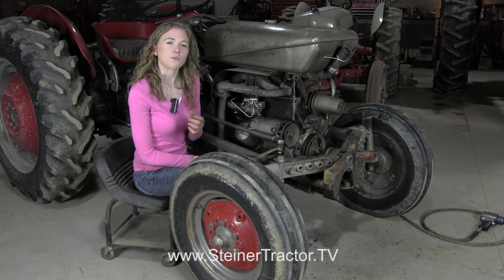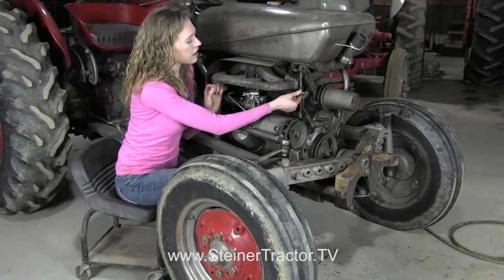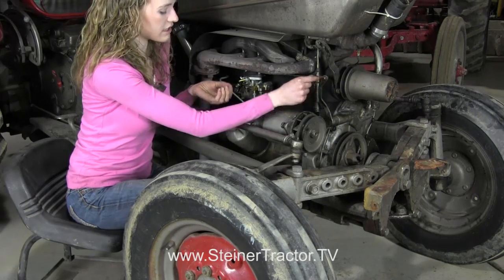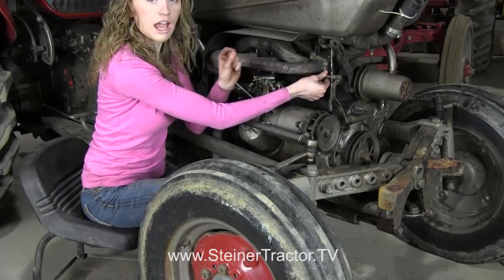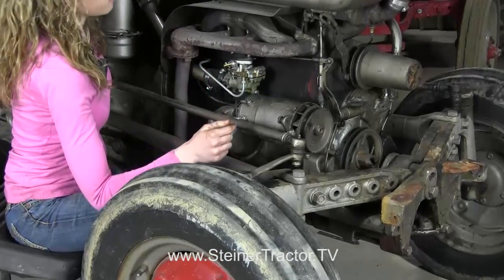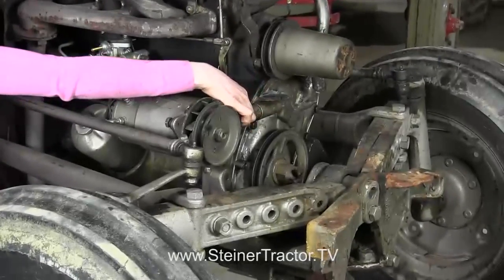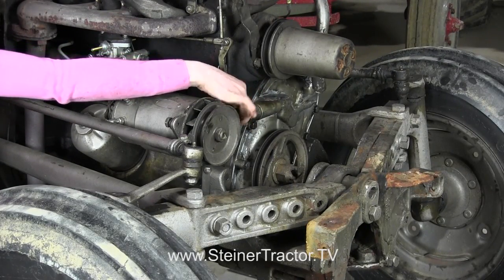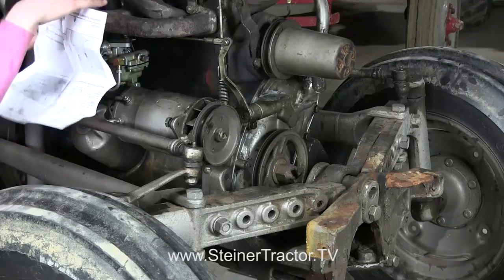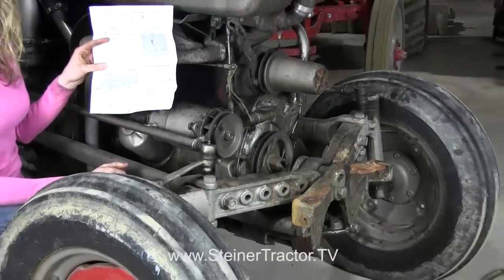My governor is adjusted, so I'll walk you through the steps we took. Right now my throttle is wide open and we made our first adjustment here with this clevis. We adjusted it out so that the pin would slide through easily, and then the instructions say for the Continental engine you take it one more turn out and then your wide-open throttle adjustment is correct. Then put your throttle on idle and you can see at the bottom of the spring that this pin that comes down is just barely making contact with that arm — that's where the adjustment should be at idle. If you need further help, there are instructions that come with the kit when you purchase the new governor.